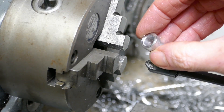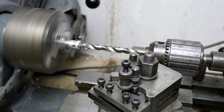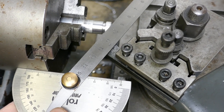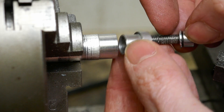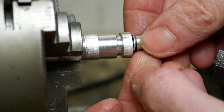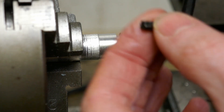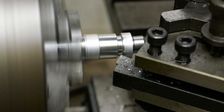This is the first stage of the misalignment spacers complete. Here I'm making a stub mandrel in the lathe to hold the pieces for further machining work. I'm setting the angle of the top slide to achieve the bevels in the final piece of work. Here I'm putting the misalignment spacer into the stub mandrel, or arbor, and tightening it up using a small cap screw. I'm about to machine the angled features in the outer end of the part. I've set the tool to cut the two angles at once — left and right.